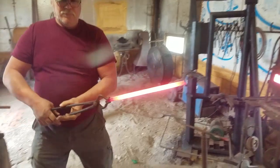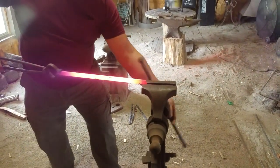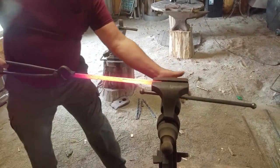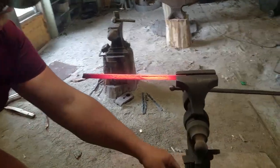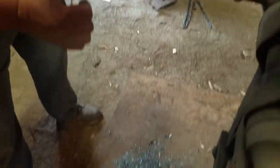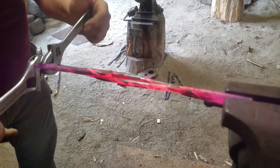We got George pulling it out of the fire here — it's nice and hot — and he's going to demonstrate the safe way to do it. Keep your arms and things back. Try not to let any of that scale fall on you. As you see, that'll start flaking off, and with a gas forge that stuff falls on you and it'll burn you.